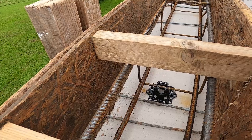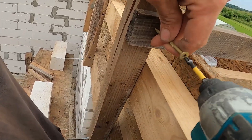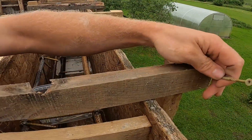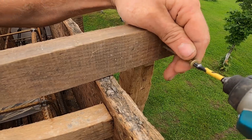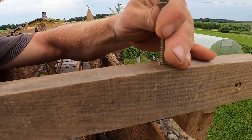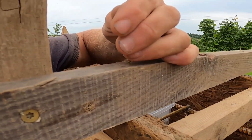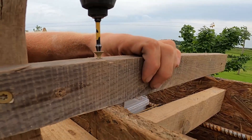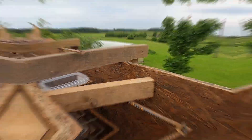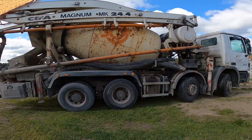Takes a bit of time to prep, but this step is key to getting everything spot on. Once all the spacers are wedged in at the top, it's time to screw on the upper support sticks — one for each side, locking into both 5x5 battens. This step pulls the whole structure tight, holding the outside and inside boards together from the top, not just the bottom. We also go through the top edge of the form boards so that once we remove the spacers, the boards don't spring back out — this locks in the final shape of the formwork. Everything's tight, aligned, and reinforced across the whole top edge. Without this step, the pressure of the pour could easily push things out. Once each section is locked in, we shift the spacers over and repeat on the next run. All the formwork is done and locked tight — every board, rod, and brace holding solid, ready for the concrete pour.